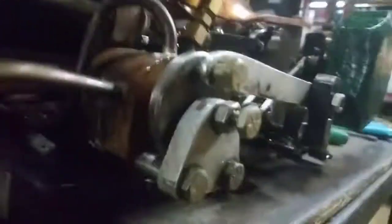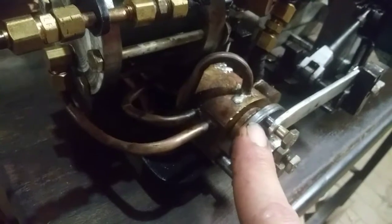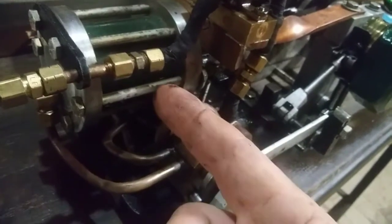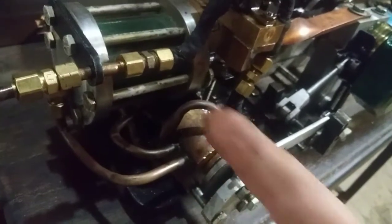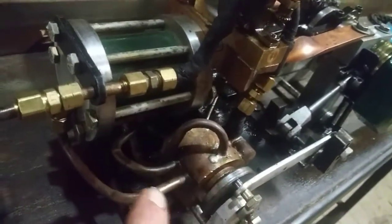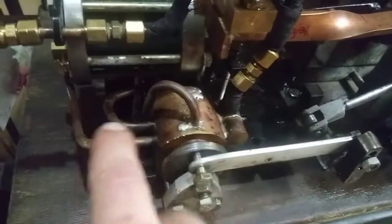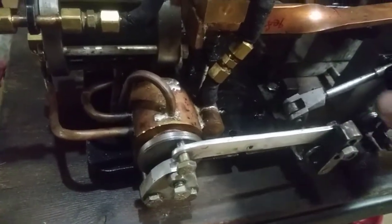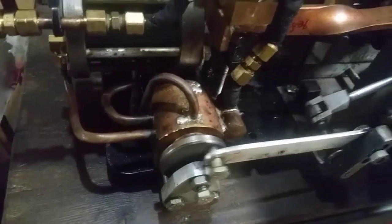My valve — this is a chunk of brass, and this rotor is stainless steel. It's tapered, and the brass has a tapered bore to match. This rotor has the taper on it to match that bore, and there are holes going through all of it to connect the plumbing. As it reciprocates, it lines the holes up accordingly and lets the steam go back and forth.